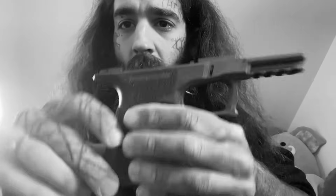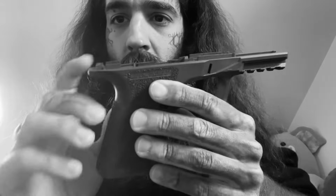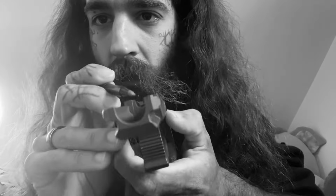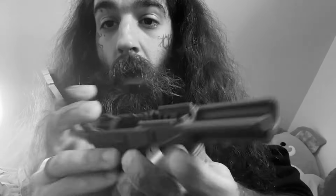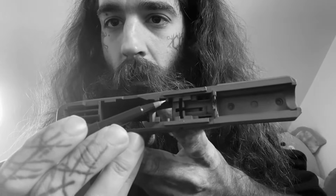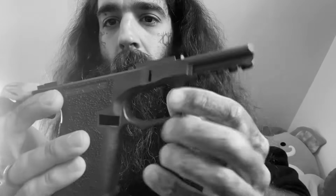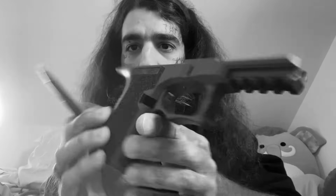So those are the things you want to remove — I'll go over it real quick. P80 things: three holes, four tabs, and the channel right here. That's what you have to do for the P80. If you have a P76, what you also have to do is get rid of this grid, get rid of these two tabs in here for the locking block, get rid of these two tabs for the front rails, and then drill the additional fourth hole as well. I'm pretty sure I covered everything, and then I'll do an assembly video in the future.